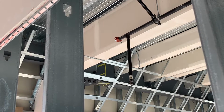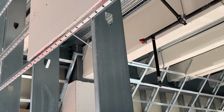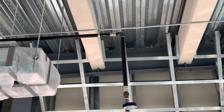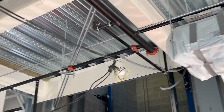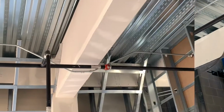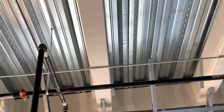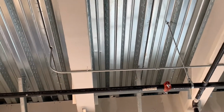I really appreciate it. So starting off the beginning of the day, finished the pipe work from yesterday, if you remember that, if you were here. Basically the pipe was already through the wall, but I'm just showing you the whole thing. Yesterday it went through the wall and it was sitting on the beam. And then this morning we went ahead and offset back up to the top beam and then 90'd up through the roof with 2 feet of pipe sticking up. And that pretty much wraps up this little project.